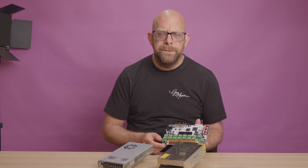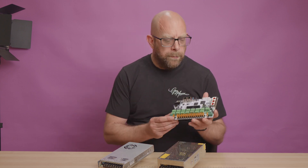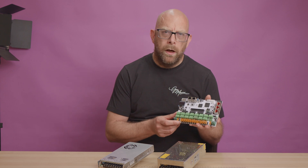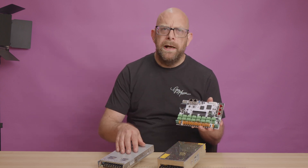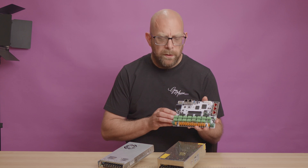Back in my first year in the hobby about eight years ago, my first prop was a simple tree run directly off the GPIO pins of a Raspberry Pi. Following the first successful year I wanted to expand, so I bought my first proper controller which was a Falcon F16 V3 — a significant investment. I wanted to make sure it had good power, so I opted to run a pair of MeanWell RSP320-12s to drive it, and they've been brilliant. They've just worked straight through with no dramas whatsoever.